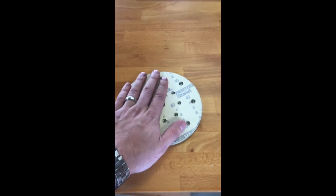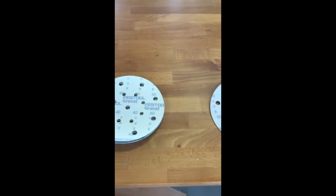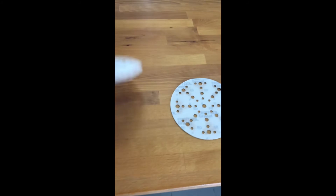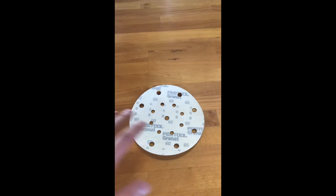By far the longest step is the 40-grit step. We're going to be removing a whole bunch of material, removing the finish, getting down to fresh wood. That's why I usually have a bunch of different 40 discs. Once you get the finish off and have a good clean finish-free surface, you really only need one piece of paper for most small to medium jobs to clean up from the 40. We're going to gunk up these 40s much more than the other ones because all the finish should be removed by the time we get to the 60. So the key is: start coarse, go quick, and work your way through.